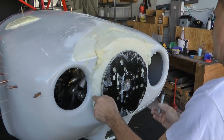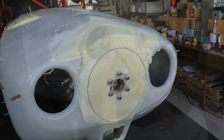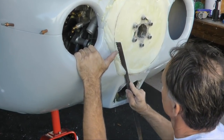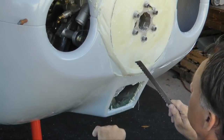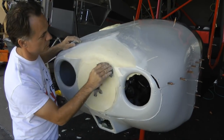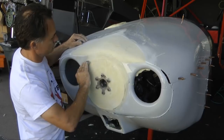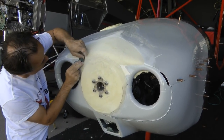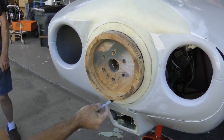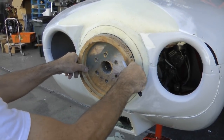Now we want to remove all foam outside of this line. This is accomplished with a blade, and then some sanding provides the contour to our liking. In order to define the inner limit of this rim, we create another smaller circular line using a wooden template.